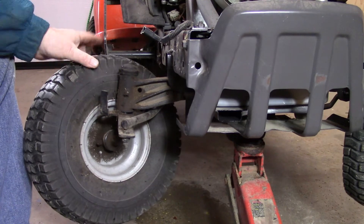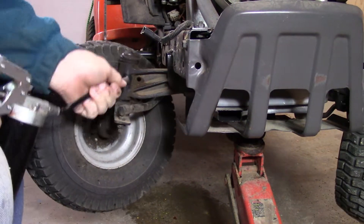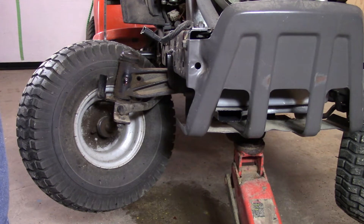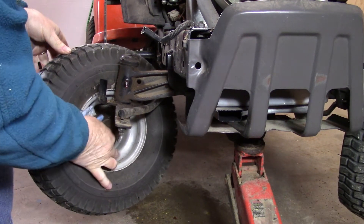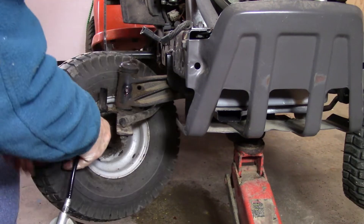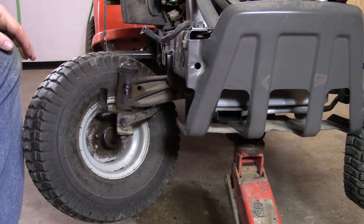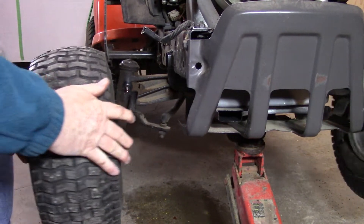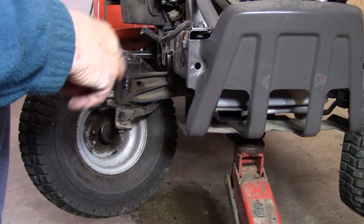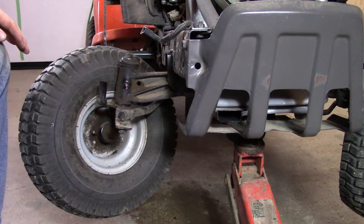Another check we want to do on the front end is the steering spindles. That took five pumps and then I saw grease starting to come out the bottom of the spindle, so that should be good. There's another fitting right here on the wheel that greases the axle of the front wheel. Since I put five pumps in the spindle, I put five in the wheel as well. That feels pretty good. Now that squeak you hear — that's the steering gear underneath the tractor. I'm going to grease the other wheel spindle and axle, and then look at that steering gear to make it a little quieter.